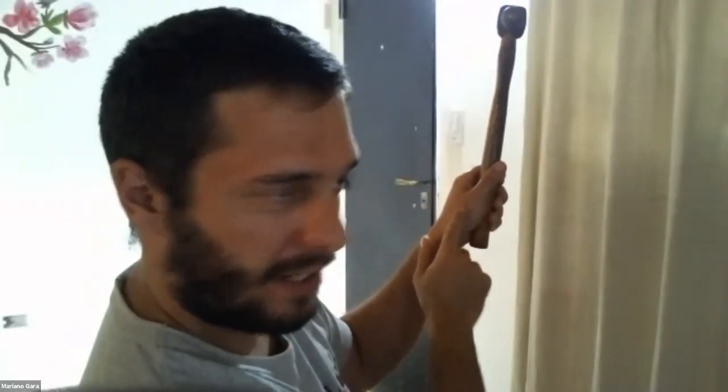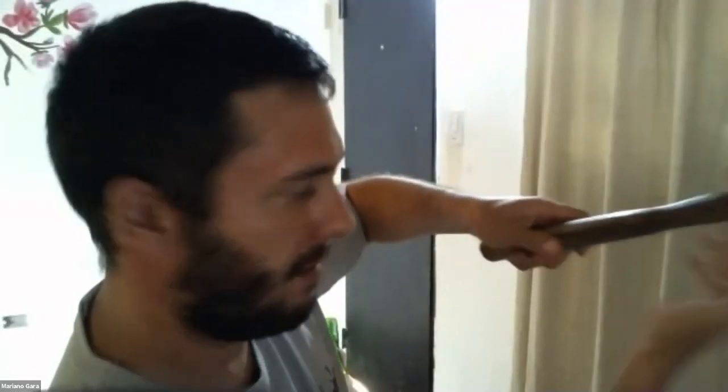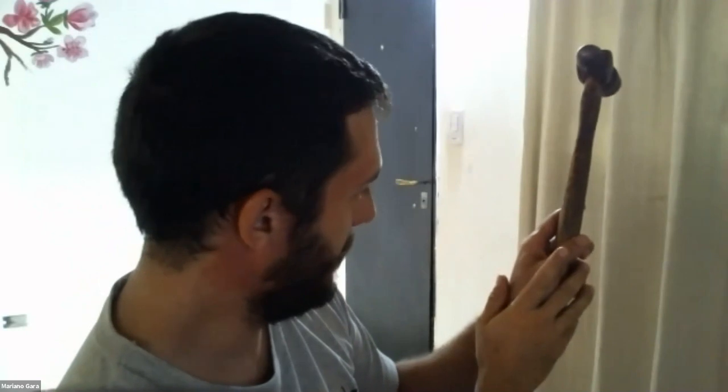It's nice to have a digit on top of the handle for control. It's a little turn and all the impact is absorbed only in this finger at the articulation. But if you turn it correctly, all the impact is absorbed through the hand and arm. So you don't feel the impact and you can forge all your life without problems. But if your hand is turned a little, it's going to be a problem — maybe after one year, two years, but it's going to hurt. And you might not notice it from the beginning, but when you notice it, mostly it's too late.